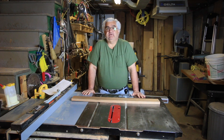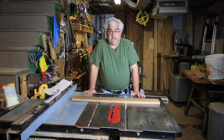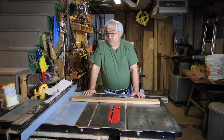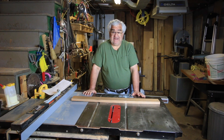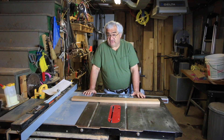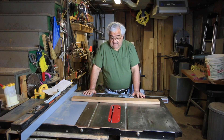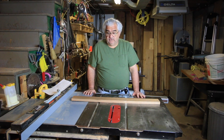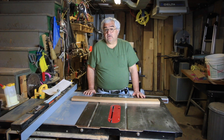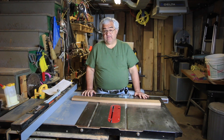The way we flatten the board — I'm going to do this with power tools. There are three ways to do this process: you can use all power tools, all hand tools, or a hybrid version with some of both. For this video we're going to use power tools, and I'm going to minimize the amount by just using three: the jointer, the table saw, and the planer. I'm going to use the table saw instead of my radial arm saw.